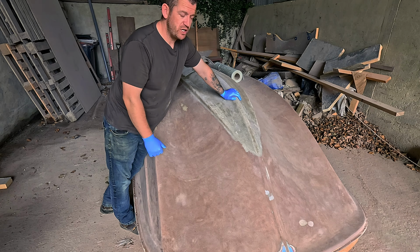There's been holes drilled straight through the boat. It's just a metal band to reinforce it. I don't personally like them. If you've got screws or bolts going through the hull, they can work loose and they leak. They always leak eventually. I prefer this, so it's sealed, it's solid fiberglass. Yes, it can get knocked and damaged, but it's not gonna work loose, if you know what I mean.